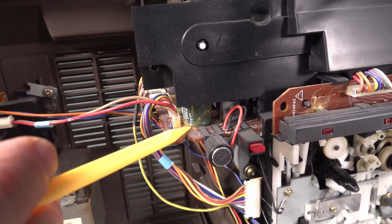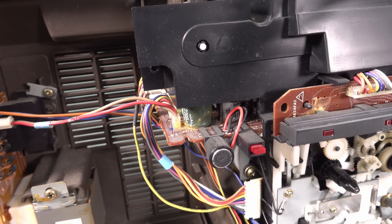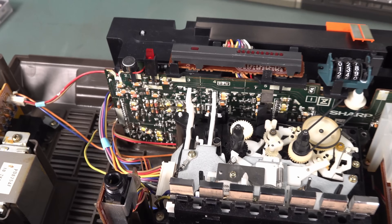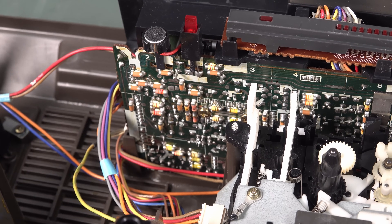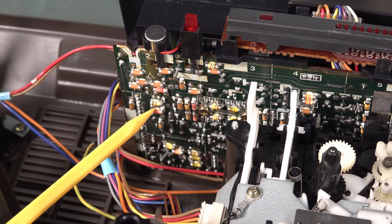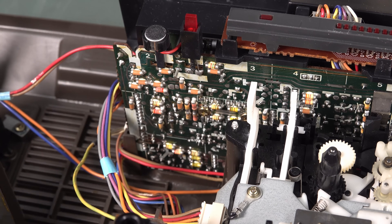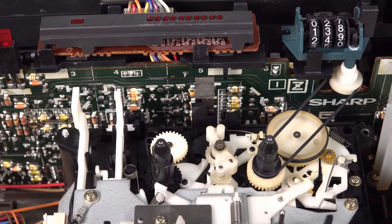This is a single-sided board on a phenolic base — none of that FR4 rubbish. And you can see they've silkscreened all of the traces from the bottom side. That is really appreciated — a really nice touch. It looks like we've got our power amp under there. We've got some Nichicon caps — Nichicons for the win! And look at all those MELFs on the bottom of the PCB! You can see how they're glued down before they put them through the wave soldering process. That's just a thing of beauty, joy forever, brings a tear to the eye.